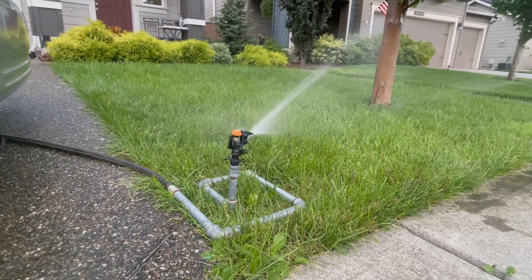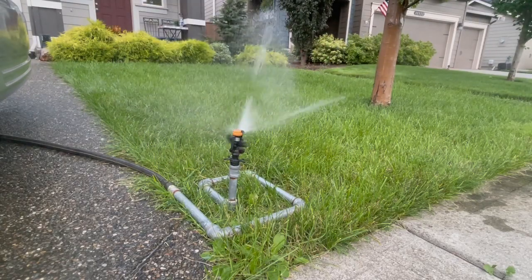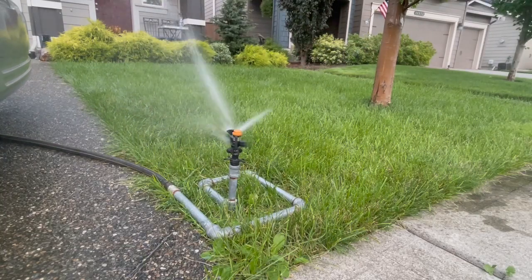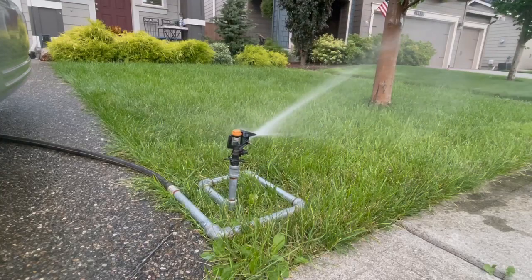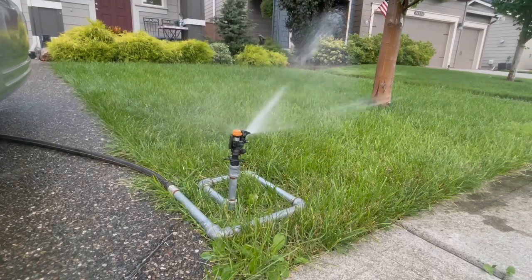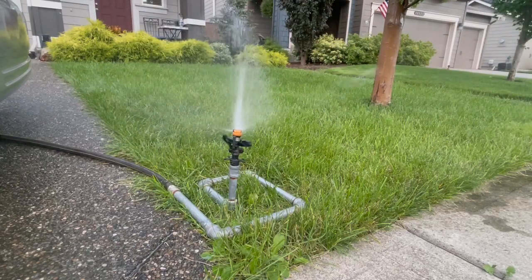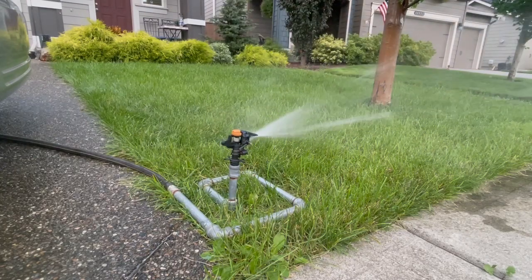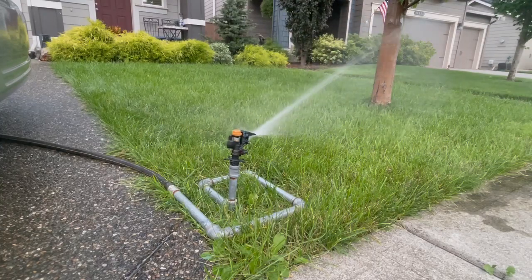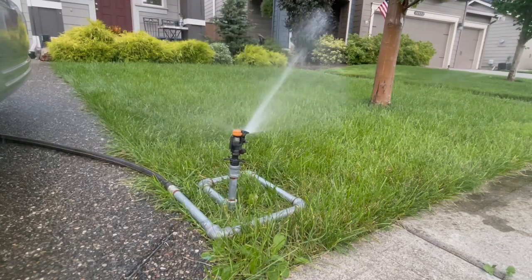And I guess part of what I don't know is when Nelson designed this, whether they designed it so that it wasn't meant to be fast. I don't know. Another thing that is also notable, the sprinklers back in the day did not have a spring above the sleeve that gave a little extra stability against the body. These are without a sleeve. I mean, without the spring, and they didn't use the springs. Rainbird didn't use a spring. Raintime didn't use a spring. Nelson didn't use a spring.